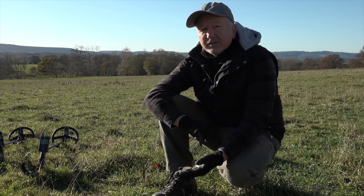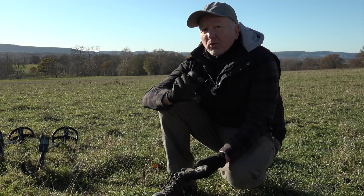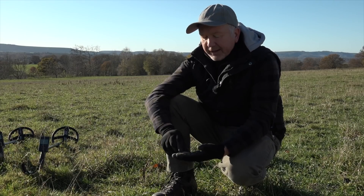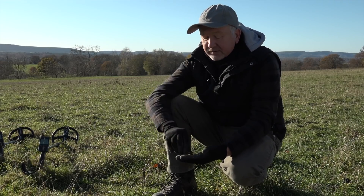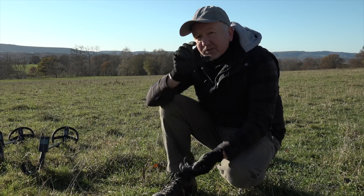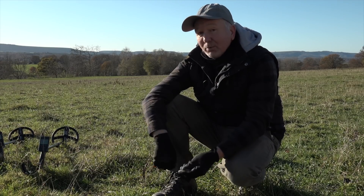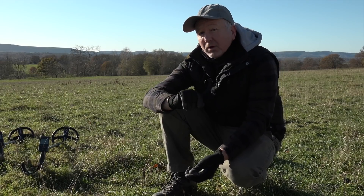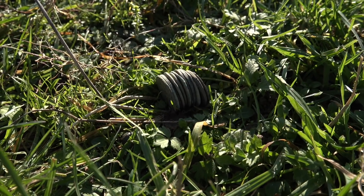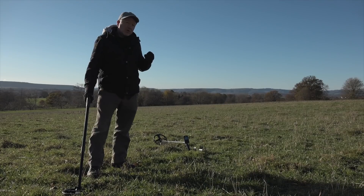One of the main advantages of simultaneous multi-frequency is frequency addition — you can add high and low frequencies to the same program in order to give you a wider range of targets: high and low conductors. I'm going to show you a little experiment with some highly conductive coins. We're going to run the Deus 1 over them and select different frequencies. These coins will be together in a line, touching, simulating a coin spill. Then I'll try the same with the Deus 2 in general mode. Deus 1, standard fast program with the x35 coil using 17 kilohertz.